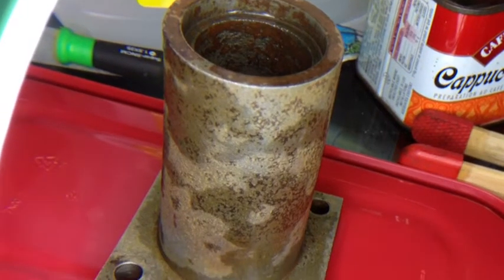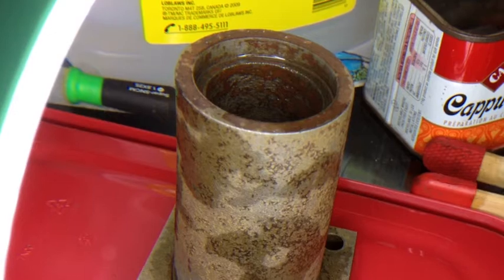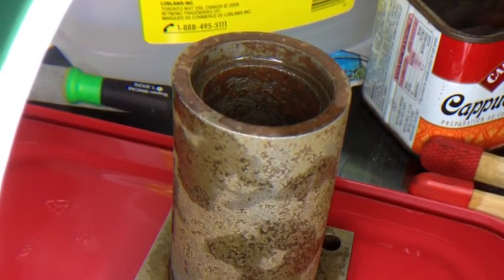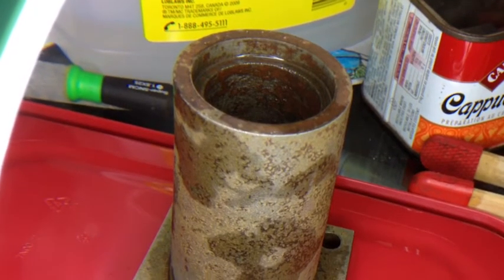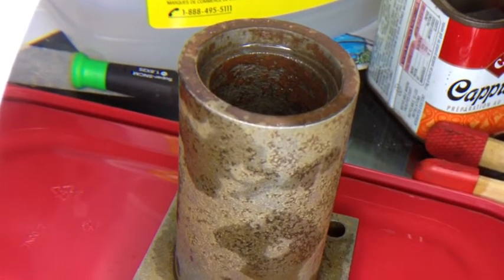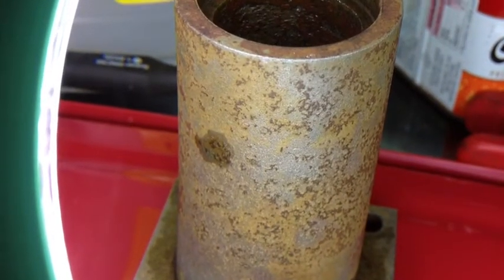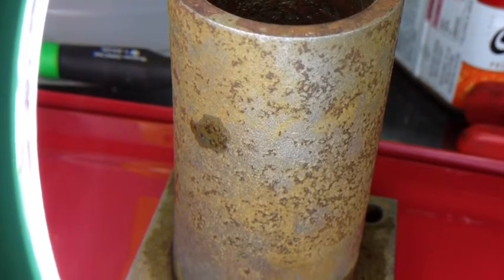It does a really nice job. I'll probably try and take that piston out of there now — should free up. Pretty nice cleanup job. It's a favorite method of mine: no power tools needed, just vinegar and a hand wire brush. Amazingly, you can see how the reaction happens with the surface.